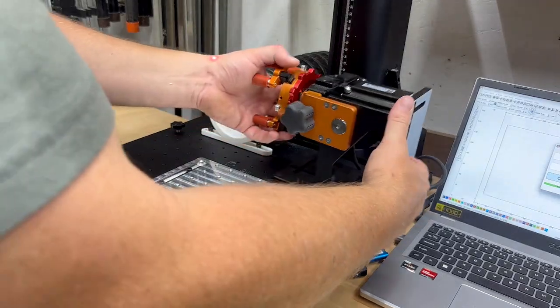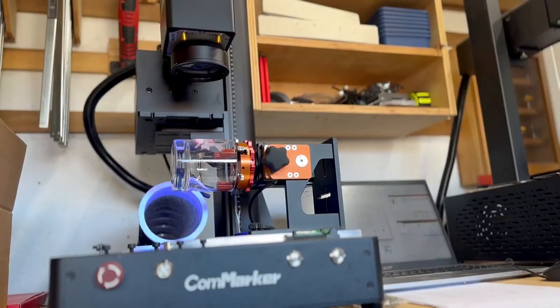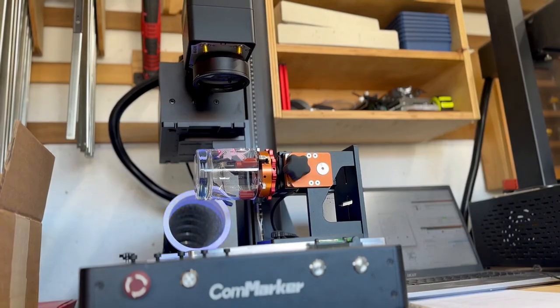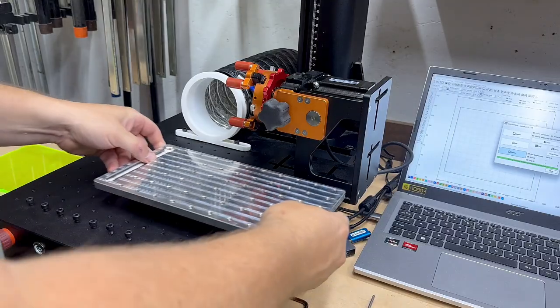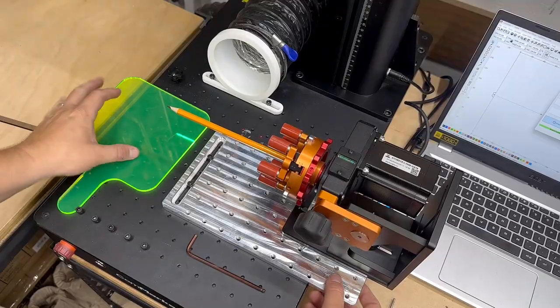To begin the installation, we'll place the rotary directly on the bed of the Omni-1. Use the threaded inserts on the laser bed to secure it into your preferred orientation. I like to position my rotaries on the right side of the bed, aligned along the X-axis. I'm starting by roughly aligning the rotary with the center of the laser lens, but we'll fine-tune that in a later step. I'm also using an extension plate on top of the laser bed. While it's not strictly necessary, I like having it in place when working with longer objects like wine bottles. The rotary needs to cantilever slightly over the right side of the machine, but I prefer giving it a little extra support. I picked this plate up on Etsy and I'll drop a link in the description.